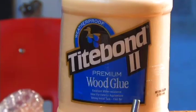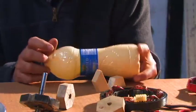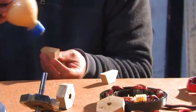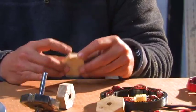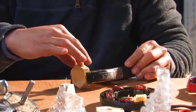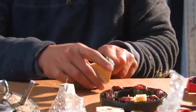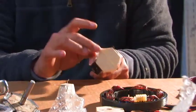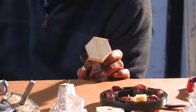So we're going to glue this together. I've resorted to putting my glue in a water bottle with a little hole on top — it works really well if you need a lot of access to glue. These don't clog up and you can actually smear it on there pretty good. So you put them together, get them lined up, and you're going to have a little glue sticking over. Take a powerful clamp — you want to make sure your fingers aren't in there in case this slips and jams shut on you. You clamp them together, make sure they're lined up, and then you let this sit for about two to three hours. The seam will actually be stronger than the wood. You want to use wood that has a fine grain with no big knots, that way it doesn't split apart on you.